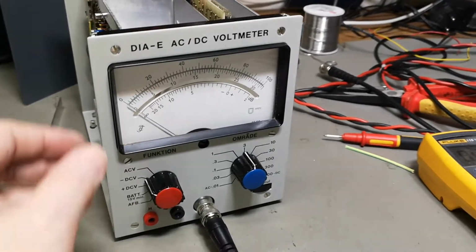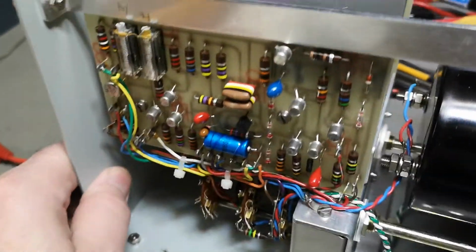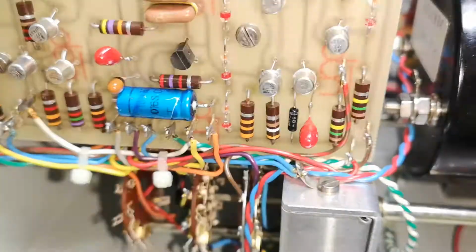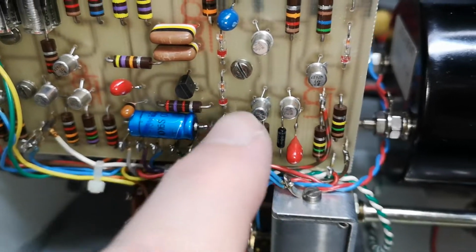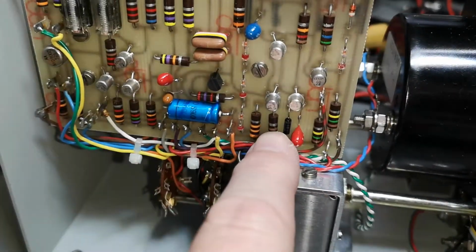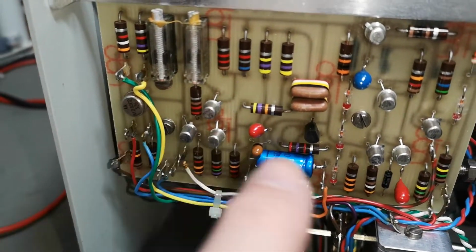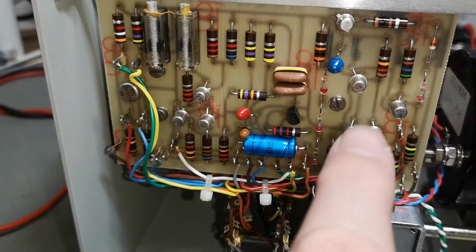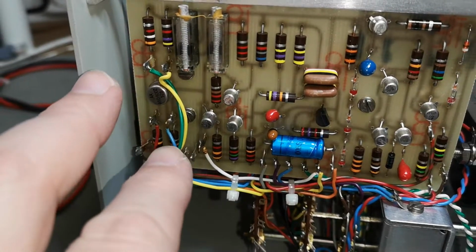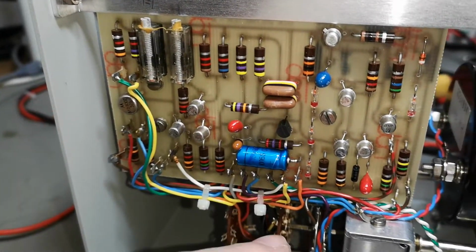Ooh, hello. Of course, I figured this out. But that was not so easy. Who would have guessed? Actually, I was looking around. There's a Zener diode here, and that is, of course, the reference. And when I poked around with this supply rail offset, that will, of course, change the whole balance. All this is a DC coupled balanced coupling. I don't know if it's easy to see, but that is actually what it is. And then this is the final output driver, also a balanced 2-in-1 unit here, and that goes to the meter.